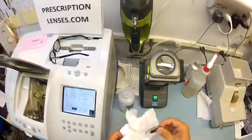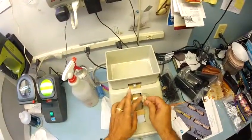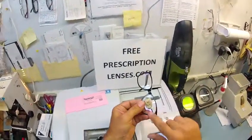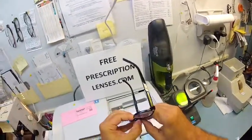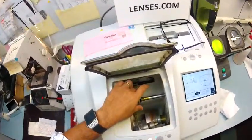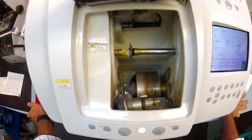Let's take your left lens out, dry it off, and over to the hand stone quickly for the safety bevel. Get off any optical sawdust that may have occurred on your lenses, and let's go ahead and get your left lens mounted. I start on the outside corner closest to me, then using my thumbs I press down. And it's actually still a little big, so I'm going to take it down just a little bit more. You can always cut more off a lens; you can never add it back on. So I always start a little bit large and work my way down.